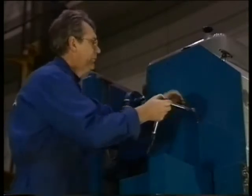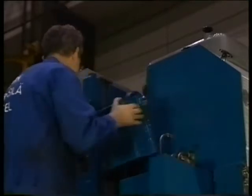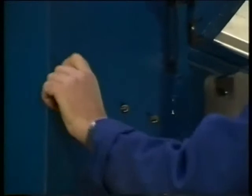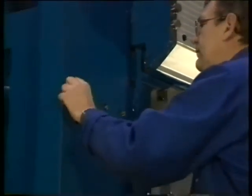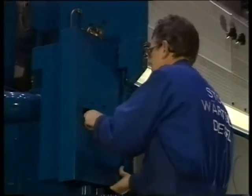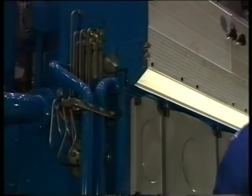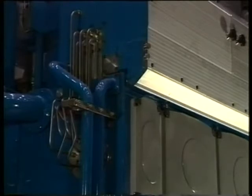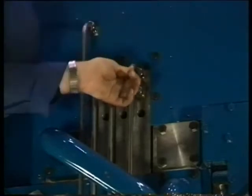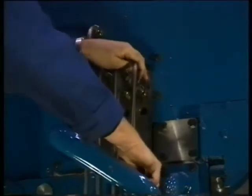In order to slide the camshaft, the starting air distributor needs to be removed. First, take away the protecting plates at the vibration damper side. Behind this, you will find the starting air distributor. Remove all pilot air lines and the air supply line. Mark them in respect to each other to avoid mistakes during mounting, and keep the pipes clean.